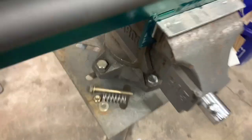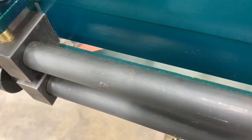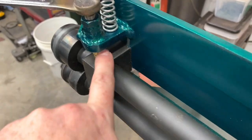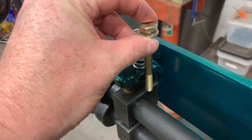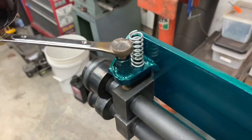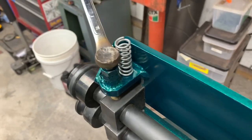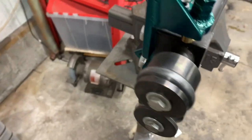So I had this thought to install a spring back here. Basically, I'm going to drill through this plate and tap into the block and run a long bolt that screws into the plate, has a washer to lock it in place, and therefore when you crank down the handle, it compresses the spring, and when you retract on the handle, the spring tension pulls the arm up and you can remove your panel from the bead roller.